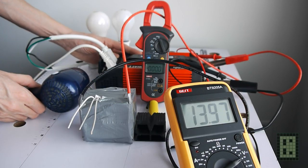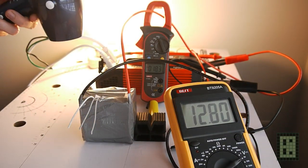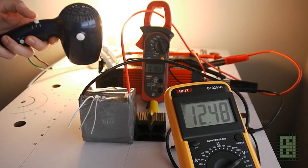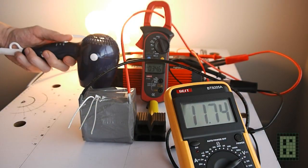As you can see, it's able to provide 200W of power for the light bulbs, but when I switch the hairdryer on low at 400W, the voltage drops under 10.5 volts and the inverter switches off.